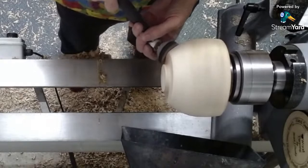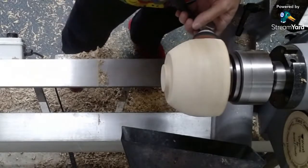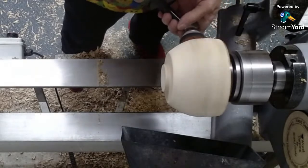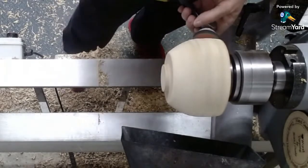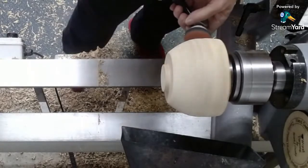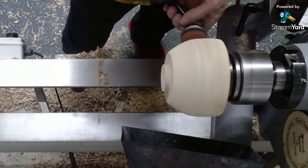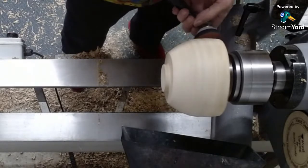Pod from Glenn. I always say if you've got a crack, put the CA on there, the cut before the final cut. And if it spreads through the top of the wood and it stains it, it doesn't matter, you're going to cut that bit off anyway. Exactly. It'll still seep down to the crack. Yeah. And you've got a nice clean edge on it. Not going to see it now.